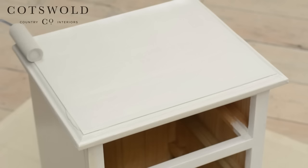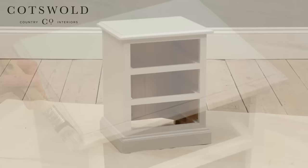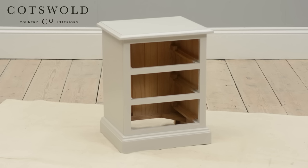The brush will work wonders for tidying up any spills made with the roller. Allow time for the paint to dry — this may take a couple of hours. Don't forget to paint the outside of the drawers whilst they are on the dust sheet, and the internals if you wish for a more complete look.